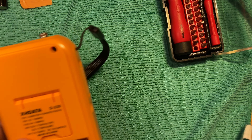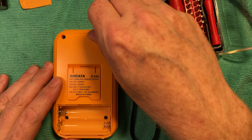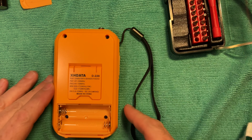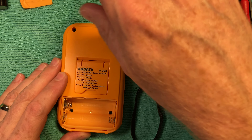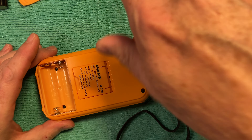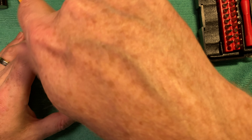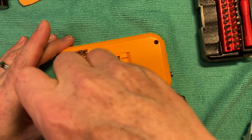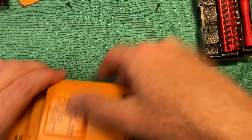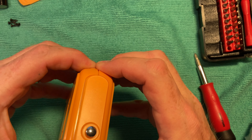So the real question is, are the chips the same as in the D219? I've also looked at the D328 in another video. Both use the Silicon Labs SI4825A10 chip as the tuner chip, and I would expect that's probably what's in here. The interesting thing about the D219 is that on shortwave it has a preamplifier, which means in some situations — as is the case for me at home — it has a tendency to overload. This one doesn't. The little bit I played with it on shortwave has been fairly decent — it performed pretty well considering I was inside and it was daytime.